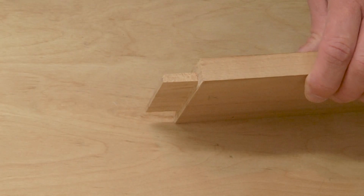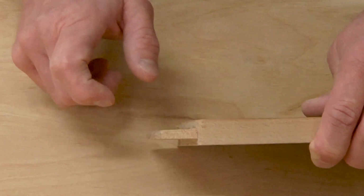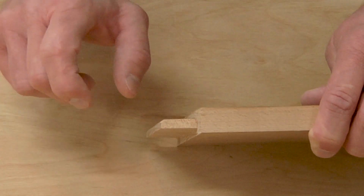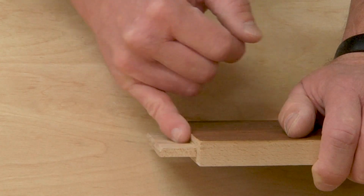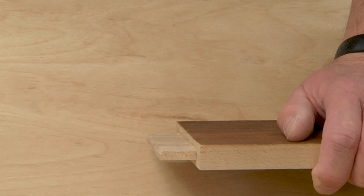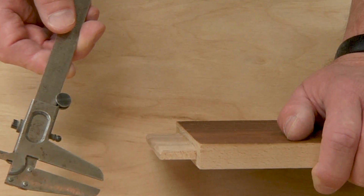This really helps give you a good idea of how you did when you're using that shoulder plane on it. A shoulder plane can sometimes tend to rock, or again, like if you saw my Wood River didn't cover the whole thickness of the tenon, I might take a little bit too much off one side or the other. So the calipers do a great job, and they're pretty low budget. Let me show you another tip now.